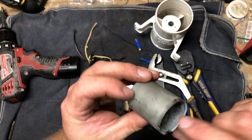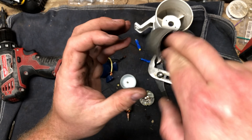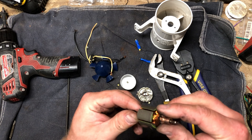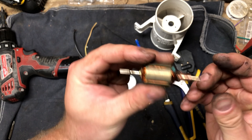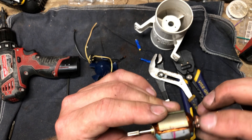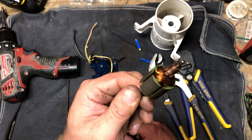We've got a plastic spacer and then just a spring. My guess is they slide these into place with the epoxy on them, some sort of jig holds it, and these springs provide the tension. As little hobby motors go, that's one of the nicer constructions I've seen of the body. We've got a DC brushed motor, a dab of epoxy for balancing, and the stake-on connectors here are not epoxied or anything — so that's where they tend to break from vibration over time.